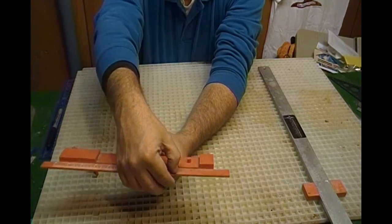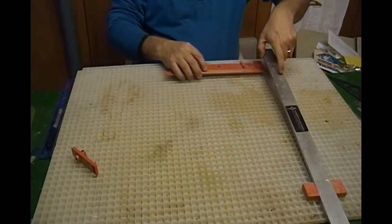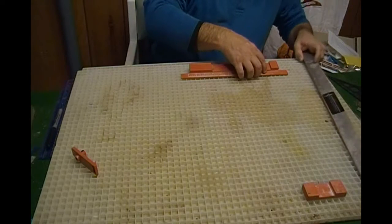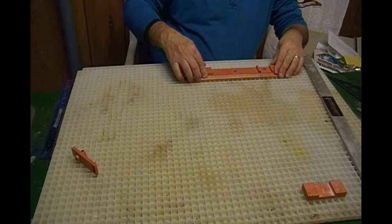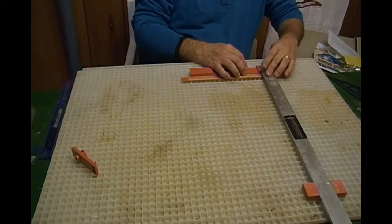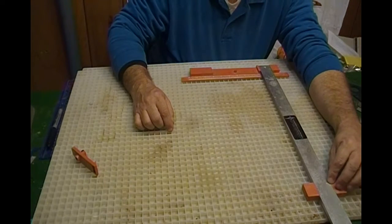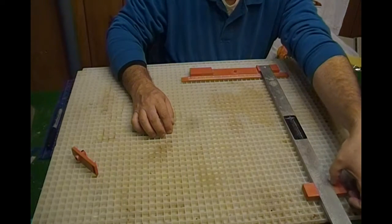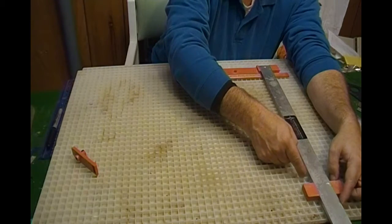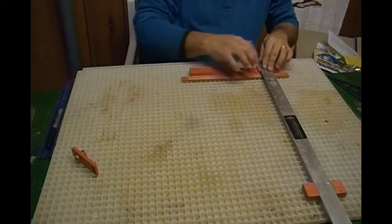But anyhow, right there's the zero mark, and then it has this 1, 2, 3, 4, 5, 6, which I like. I like the ruler on here. So it's got the zero mark on here, and what you can do is line up that zero mark or line up the center right there, center this so that this bar fits right in there, sits on that pin. And again, Don Doak recommends you find out, because see there's a little bit of play in here, you can tighten that up by shoving some tape in there or a wedge or something so that it holds on the correct side. But for some people, that little play right there, hear it, is enough to set things off. And same thing down here, there's a little bit of play that can be fixed. Anyhow, now it's set on the zero mark.